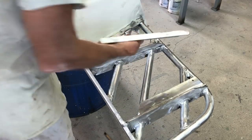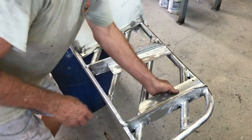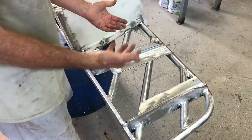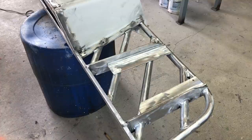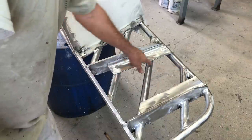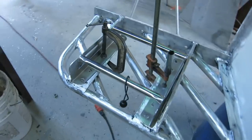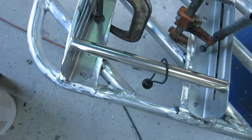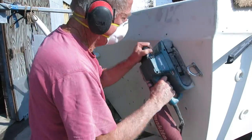I've got the little pieces gnawed off so they'll go over these welds — I just need to clamp them and weld them. Needs to be a pretty good weld because the swim step anchor will be in tension trying to break the welds when big guys get on there. I'm going to get a good bit of weld along here, here, and here — it'll be all right. While I've got it upside down I might as well drill a hole so I don't have to drill it laying on my back looking up later on.